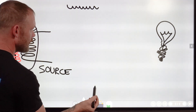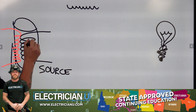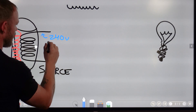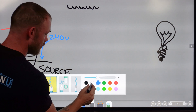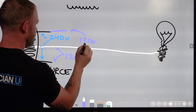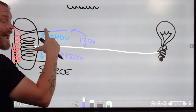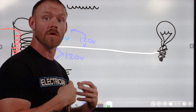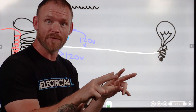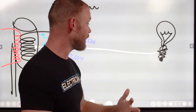Let's break into it — hot and neutral, which is how we work in the field. A neutral is just another conductor tapped at the halfway point. Between hot and hot we've got 240 volts, which means we have 120 volts between each hot and the neutral. That's a miniature circuit within the larger 240-volt circuit operating at half the pressure. We don't need as much pressure to turn on a light bulb, so we only run 120 volts to it. It's a way to split that pressure and get two different circuits at a lesser pressure.